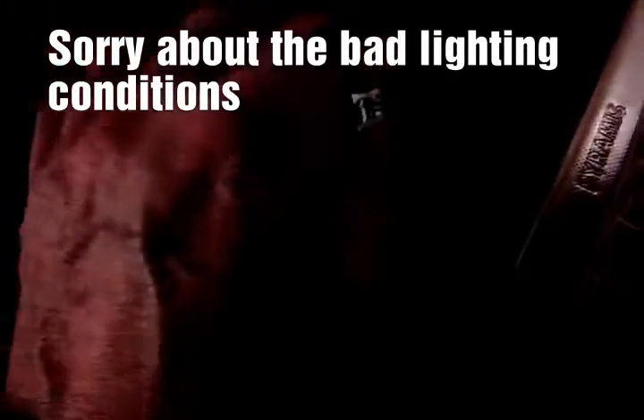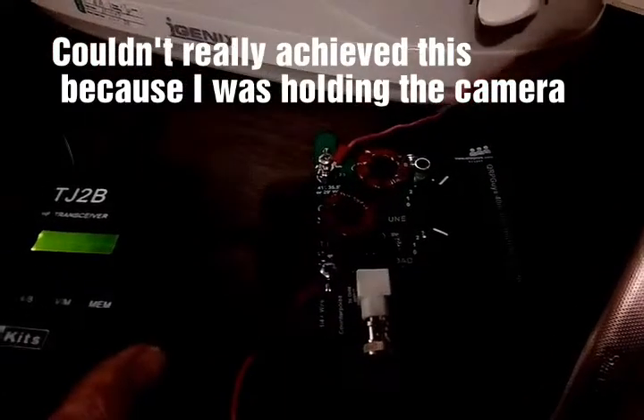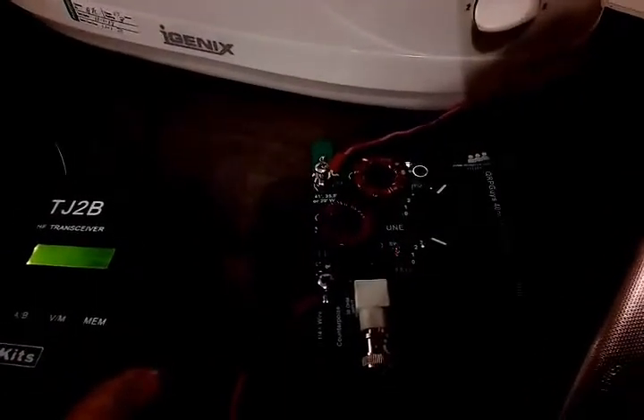I've got it in my radio set to there. On this little handheld HF transceiver I've got to have it on continuous wave. If I show it to you on tune — if I push the transmit button you can see the light actually lights up. By tuning these little knobs here you can actually get it down to literally nothing, and that is pretty good. That would be pretty much a good SWR. By just rotating these slightly — if I rotate it a little bit more you can see I knocked it off slightly. Then I've actually got to reset it and tune it in. It does actually tune up quite well.